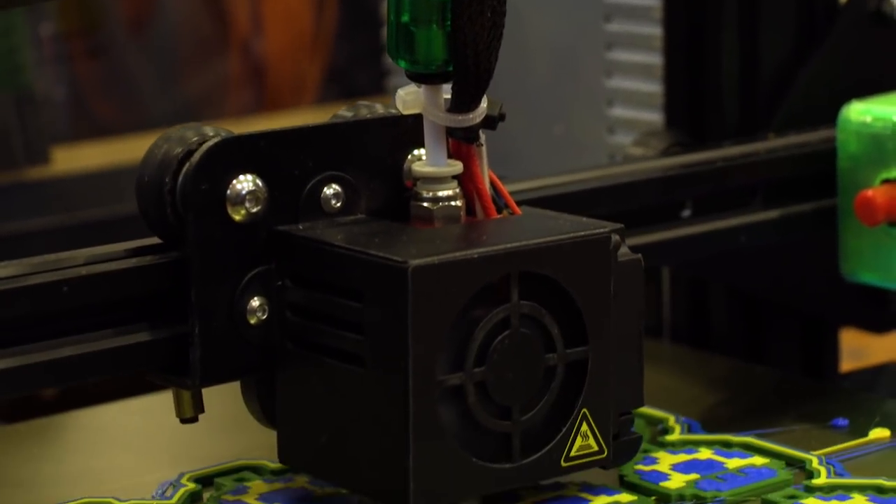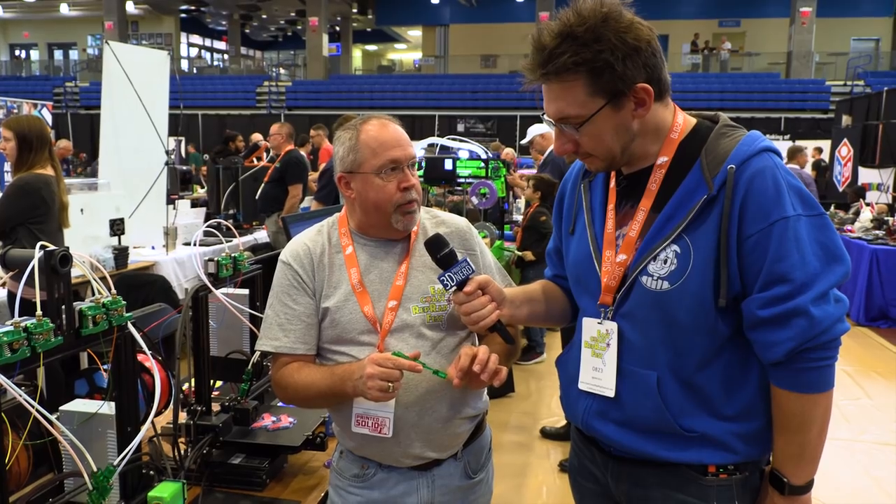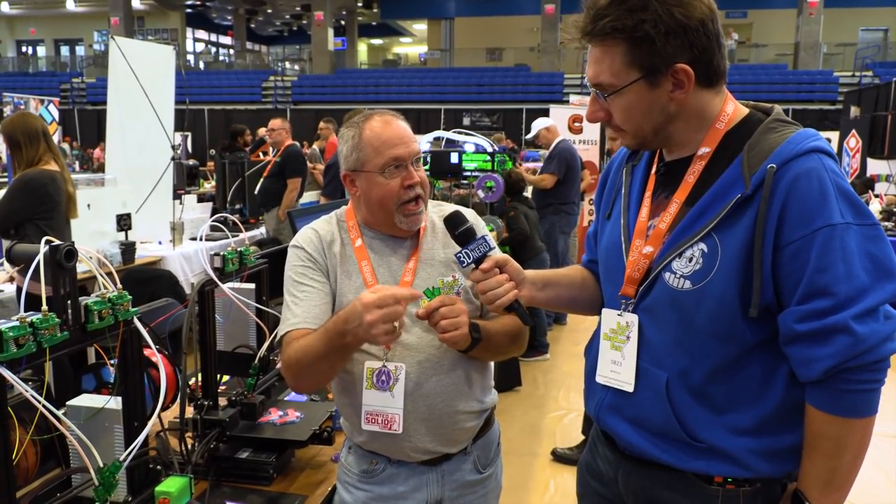Prusa MMU1, which this is based off of — they kind of abandoned that approach because they couldn't get the tip shaping quite right. So the last year I've actually spent researching and understanding what the actual issue is. It breaks down into a couple of issues: the PLA filament swells, you get stringing on the end that curls up and kind of jams on itself, or you'll get blobbing. So I decided to tackle it by making it fault tolerant to allow those features to exist and not jam.